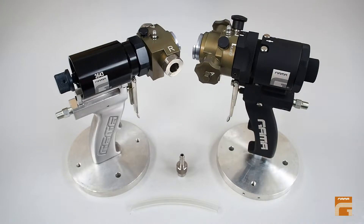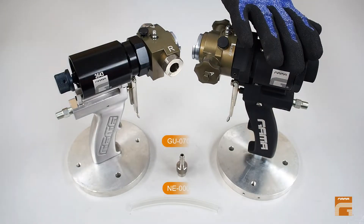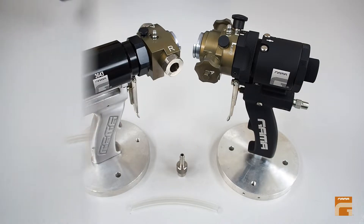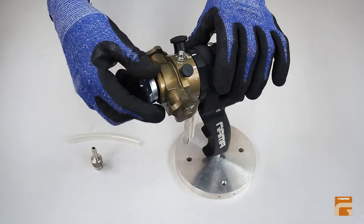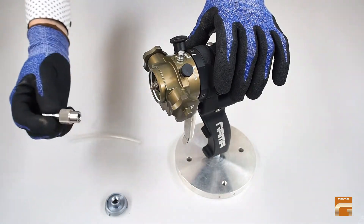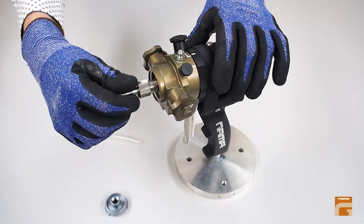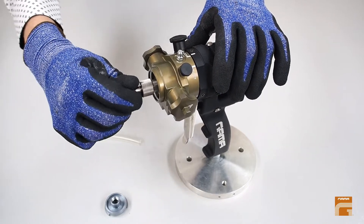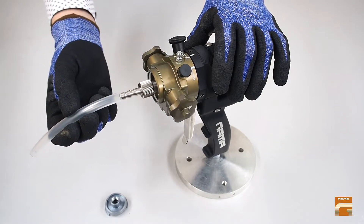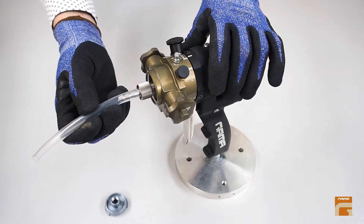The adaptation to convert any of your Master 3 or black gun is very simple. You will need only a special pouring adapter and a piece of a disposable plastic tube for convenience. Remove the diffuser from the gun, put on the pouring adapter and twist it on the tip of the mixing chamber, then fit the plastic tube of the desired length on the nozzle.